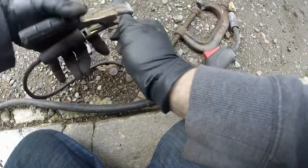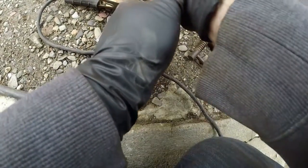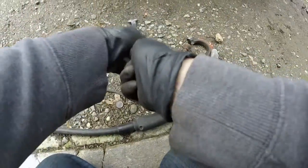Another thing to note, and you won't see it in this video, I did it after everything cooled down, is you need to paint, or scrape everything off with a wire brush and then paint everything, because all this will just rust almost instantaneously. So I painted everything right after I got this all welded together, when it was finalized. You can't really see much here, but I'm welding the washer on. I am working on making it so I can see things a little better with the GoPro. So now we're going to clamp this directly on here and we are going to weld it.